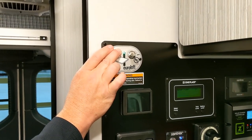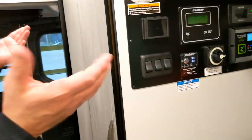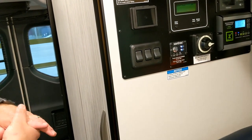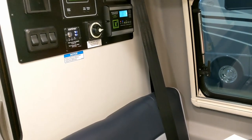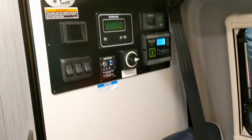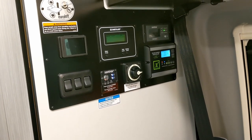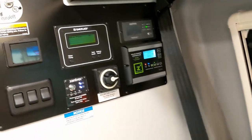A lot of people lift the bed up until it almost touches the ceiling, storing totes underneath. Some people have put a larger fuse in — that's not smart. You overheat and burn out the motor. It's engineered for a specific load. Someone tried a bigger fuse and eventually blew the motor.